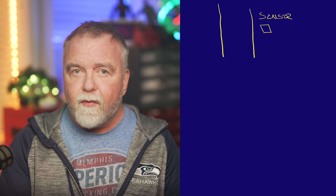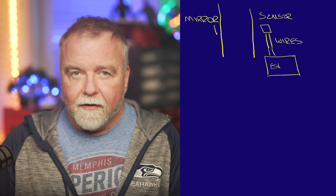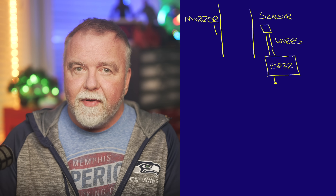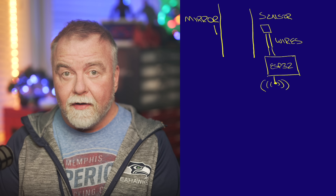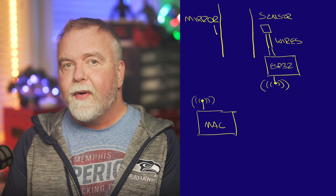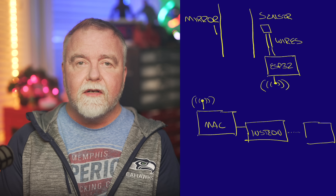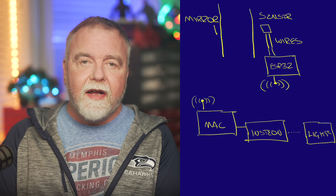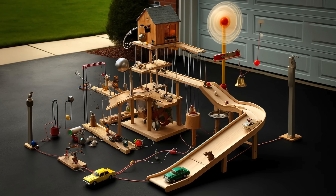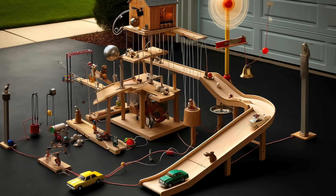The driveway sensor lives at the end of the driveway. It shoots a beam of light across to a prismatic reflector that sends it right back to the sensor, where an optical receiver senses that the beam is complete. When a person or vehicle breaks that beam, the sensor closes the contact relay. That relay connects an input pin and ground on the ESP32, which maintains a WiFi connection to my IoT network. It notices the closure and sends an HTTP web request to the Indigo web service. The web service plays a WAV file on the shop's speakers, notifies the alarm panel, and turns on the driveway lights by sending command packets over a mesh network controlling all the lighting switches. It's just complicated enough that Mr. Goldberg would be pleased, but the rest of the pipeline has been reliable for decades, so I just needed to tap into it.